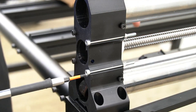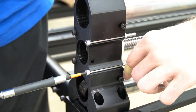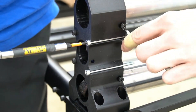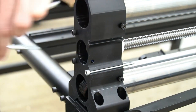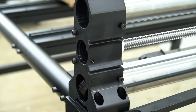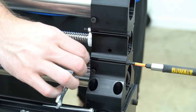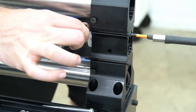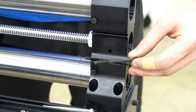Once we've removed the first two nuts, we'll slide that bracket off, then remove the two nuts behind it. Once all of those nuts are removed, we can pull these bolts from the foot of the X-rail in preparation to mount the motor. On the opposite side of the X-rail foot, we're going to remove the bolts and nuts with a four millimeter hex key and an eight millimeter crescent wrench, then pull those bolts out so that we can mount the motor to the end of the rail.